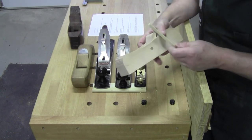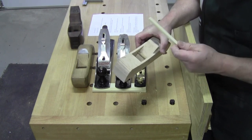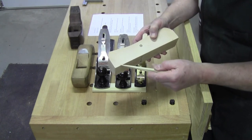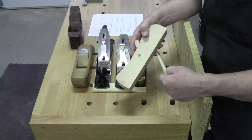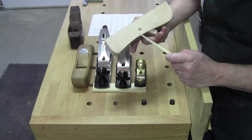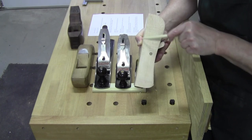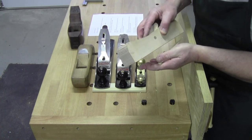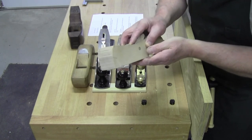So that's one of the reasons why you use quartered lumber and you put your sapwood down. A second reason is it also keeps your blade set flat on a bed longer without constantly updating it. The other thing is you want your grain to run so that as you're going back this way — see how this is running like this — it's running out this way. What that gives you is like petting a cat — you're petting with the fur, going with the grain of the wood, so you get less wear.